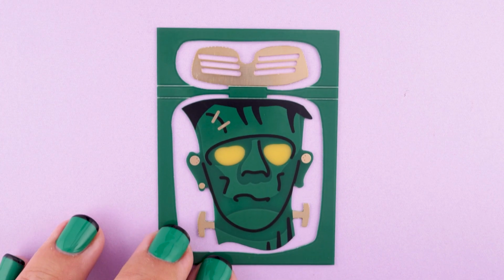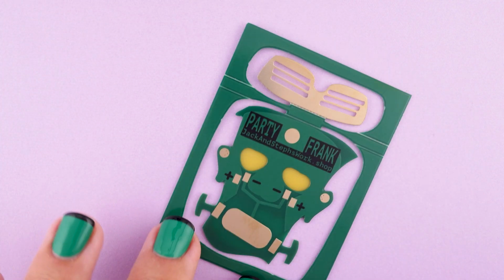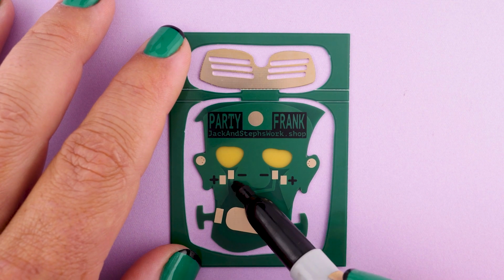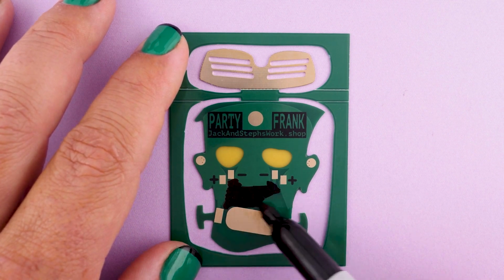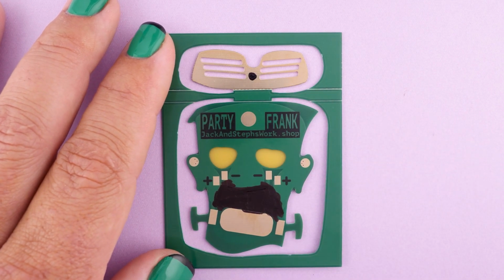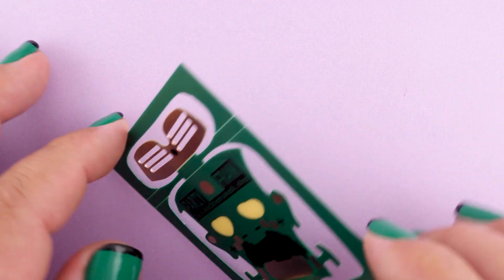Now we'll begin our assembly by turning over the pin and working on the backside. Starting with the black permanent marker, we'll fill in this section above the battery contacts and below the LED contacts to prevent light leaks. And then we're going to put a dot on the shades up here just to mark which side is the back.